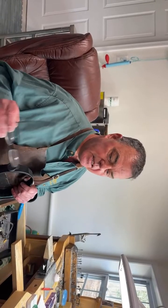If you didn't get a chance to tune in to watch this, you missed it. It has to be done at a quick pace because we want the temperature to be exactly the right temperature to cast, and then the flask needs to go in the water soon enough so that the plaster doesn't break apart. Then we have a problem getting the ring out. It could have even been a little bit hotter when you saw that flask.